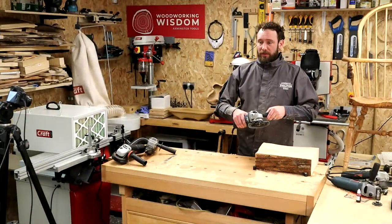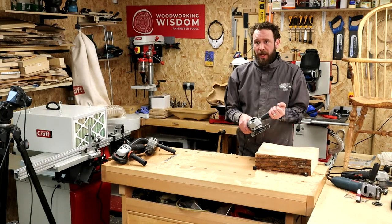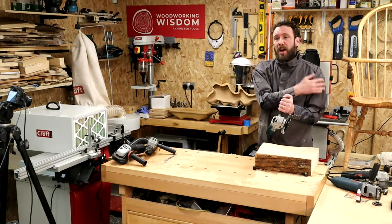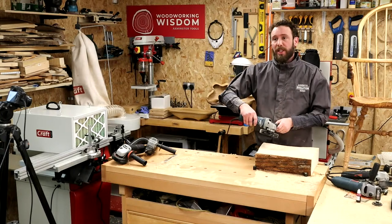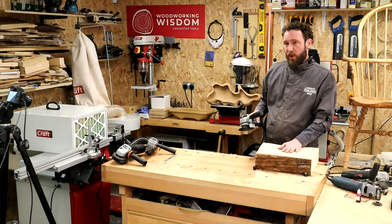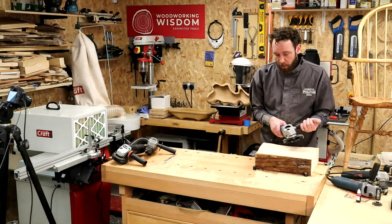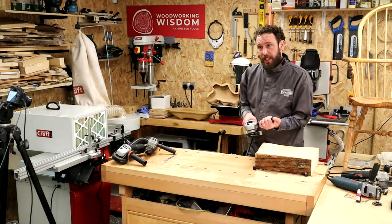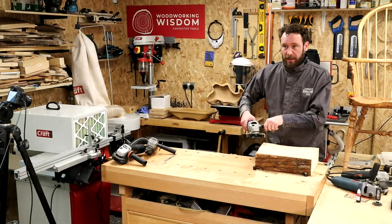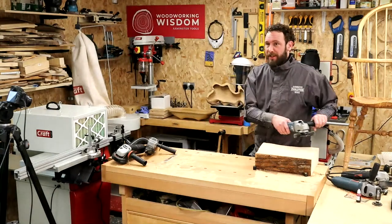So bring your elbows in. Your wrists are still doing the work, the positioning of the tool, if you will. But those elbows and shoulders aren't doing much work. We don't need too many pivot points, otherwise you can get little catches. So it's really important we keep the workpiece really well held and keep those elbows in and work on the piece. And if you need to sway your body, it's better to do that. You've got more strength in your core. So more like that and less of that.